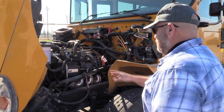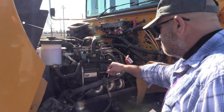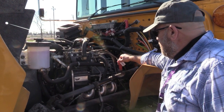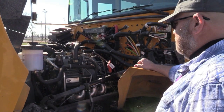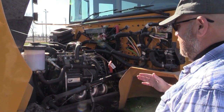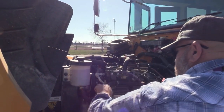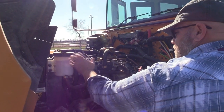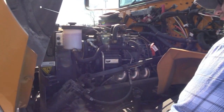Now on the left side of the engine compartment, I'm going to check my belt-driven air compressor and governor to make sure it is mounted and secure with no audible leaks. I'm going to check my transmission dipstick to make sure I am at the safe, proper operating level. I'll check my overall engine lines and hoses to make sure I have no fuel or fluid leaks. I'm going to check my power steering reservoir and cap to make sure it is mounted and secure, the lines and hoses are connected, no leaks, and at the proper operating level. I'll check my gearbox the same way — mounted and secure with no leaks.